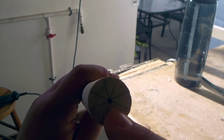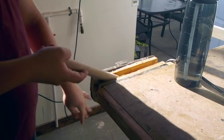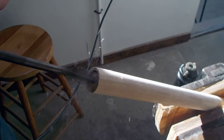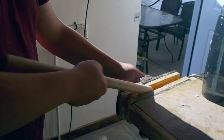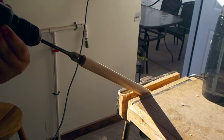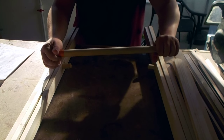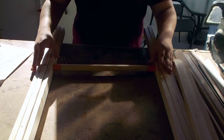I have a one-inch dowel here, and I just went ahead and found center with a center finder, made a little divot with a scratch awl, and I'm going to take a three-quarter-inch drill bit and drill this out. This is going to be for the handle of the table. I just wrapped some masking tape around the edges here because the walls were getting a little thin where the hole was, and I wanted to make sure it had a little reinforcement. These two dowels that come out of the side pieces just slip right into the holes on the handle, just like that.